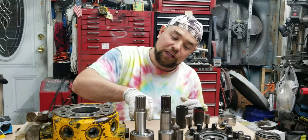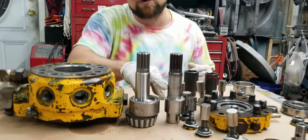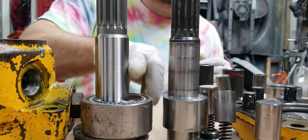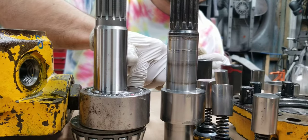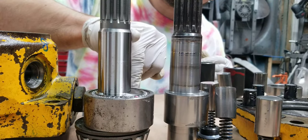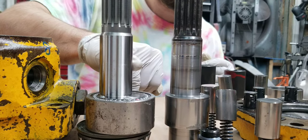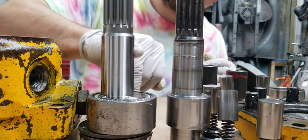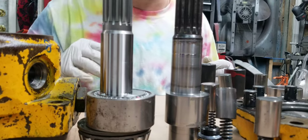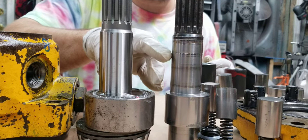On the new shaft, see all those grooves — they came from wear where it's not supposed to be like that. This is what it's supposed to look like: it's a little thicker where the bearing seats, then a little thinner here so the bearing can get to its seat without having to press it all the way through. Very good design idea.